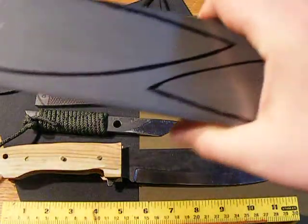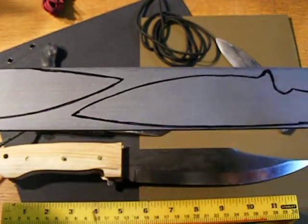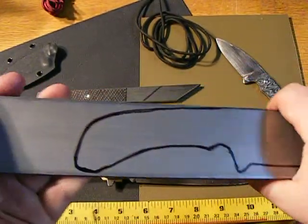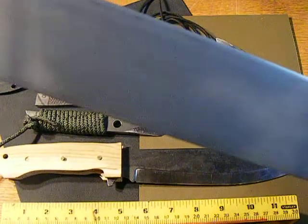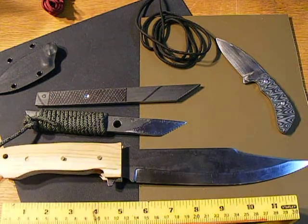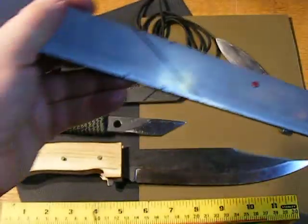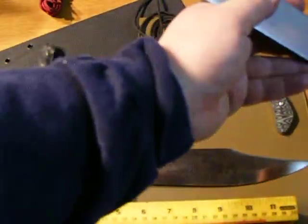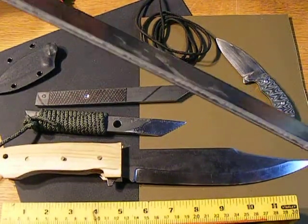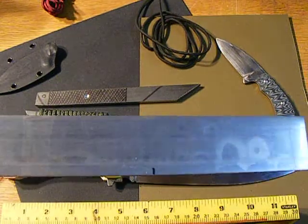I bought a lot of steel — this is just a fraction of what I purchased. I'm going to make some large choppers. These are 10 inches and they're going to be wicked. I don't know what kind of grind I'm going to do — maybe one Scandinavian, the rest full flat, or two Scandinavian and two flat. This is 1095, 5/32 by two inches. I also got some 1095 here which is 3/16ths. 3/16ths is my favorite thickness in steel — you can work it down to what you want. 1/8 inch is great for small camp knives, but 3/16ths is just a lot more versatile and you can make some pretty badass blades with it.